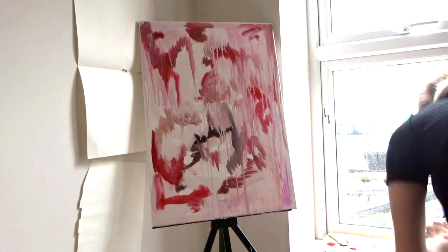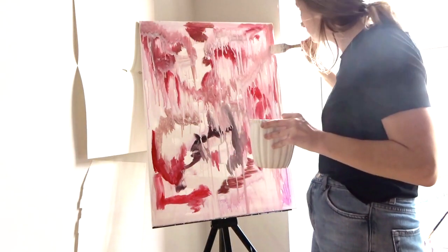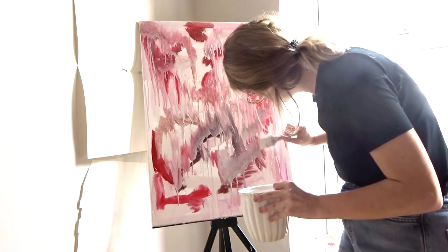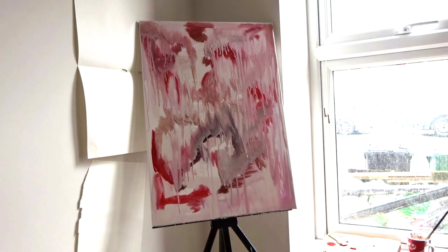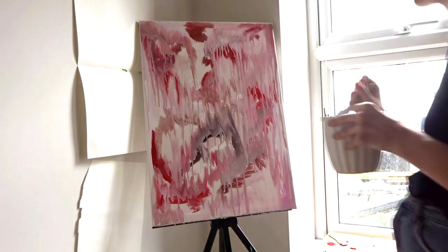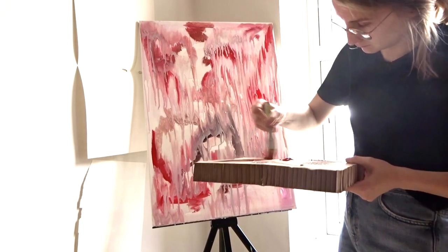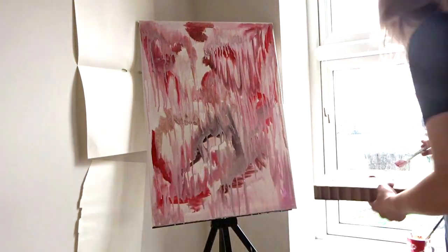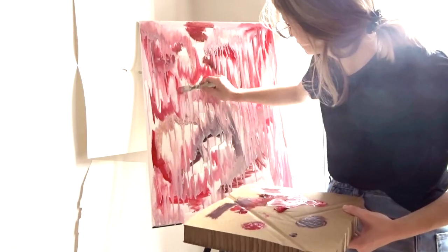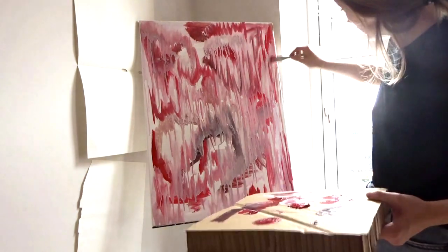I'm going back in with the watered-down emulsion paint. As you can see, it's running down quite a lot, so please protect your floor because it will stain. I'm using a flat artist's brush — slightly smaller than a wall-painting flat brush. The beauty of this is you can do broad strokes and create fine lines, jabbing into the drips and carrying the color across. It started looking a little dark and over-toned, but I wasn't too concerned — I can always go back in with that watery emulsion.